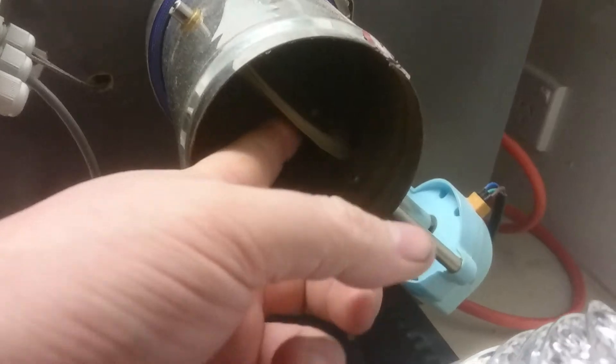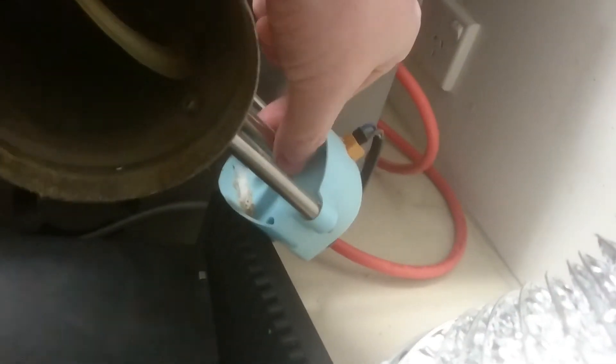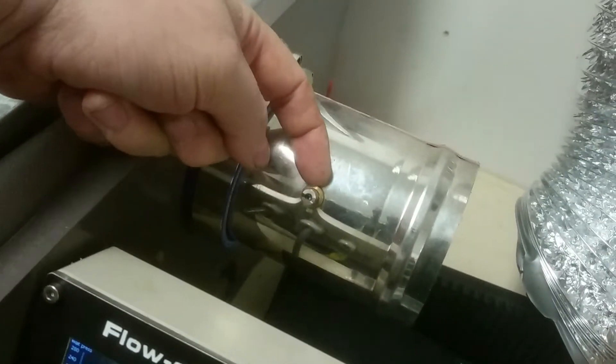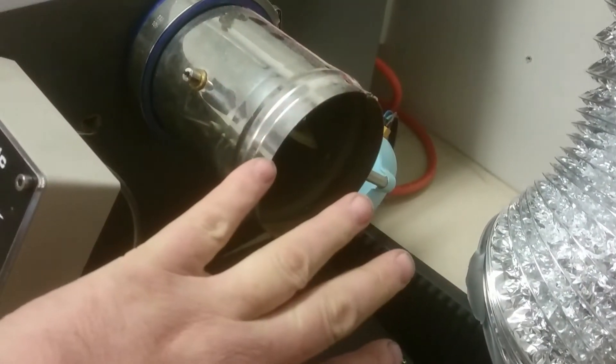We kept the original butterfly. I made this shaft up. Normally this bit sits up against this body, and that bit's plastic — it obviously wouldn't last very long. So I just remade the shaft to put the butterfly valve in there, and I added phosphor bronze bushings. This is just so that we can extract the fumes out when we're done.